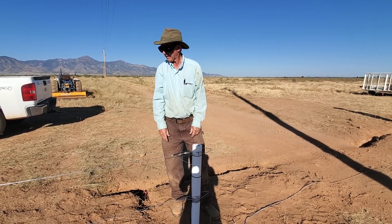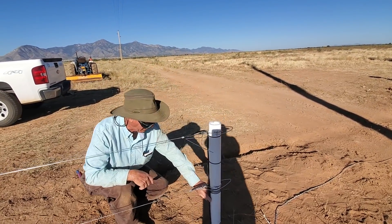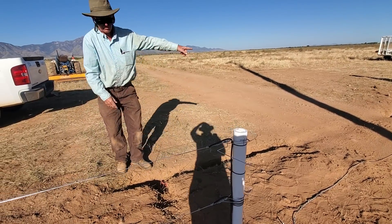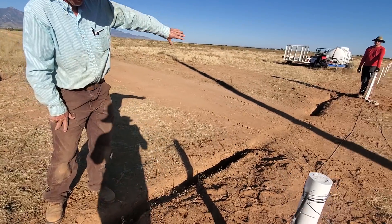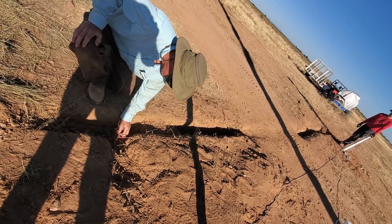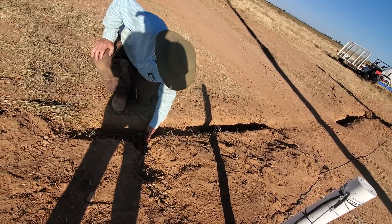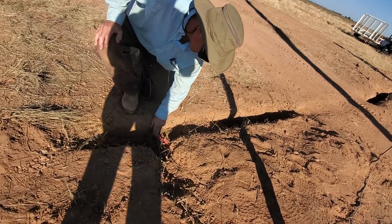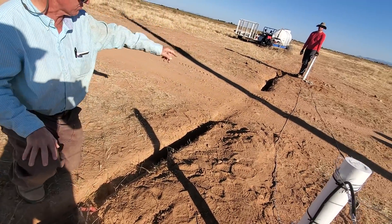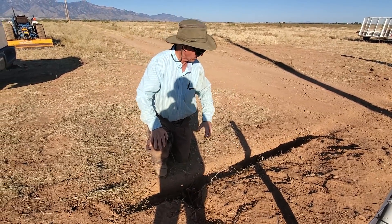You see this black wire coming up right here — this is buried wire. It comes down in this trench, and we actually augered a trench underneath this road. We put it in PEX tubing, so we're running a ground wire and a hot wire, both going through that PEX tubing, sealed in caulk to keep the dirt out. The PEX goes all the way underneath this road.